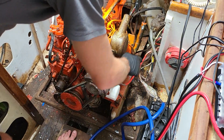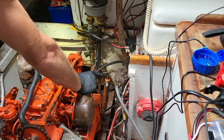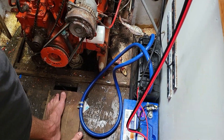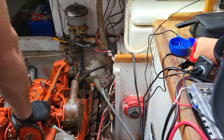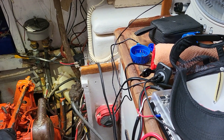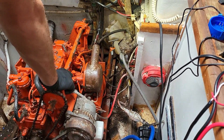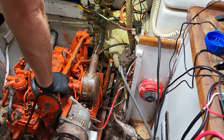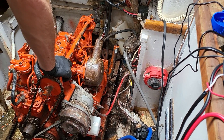You've got your numbers there for your R1232P pre-filter — when you have your final fuel setup, I would hook that up. I want to get a separator as well — like a water trap? That is a water trap — the water will go into that clear bowl on the bottom, so you've kind of got that sorted there. I'll have a few spare filters of those on board — always good. If you get bad fuel, that's the first one to block up.